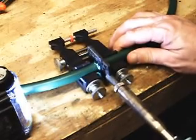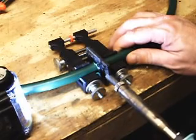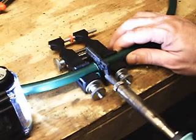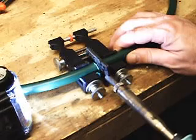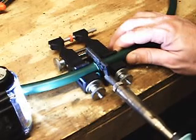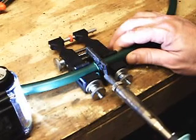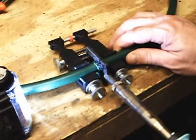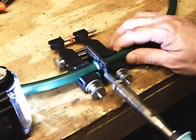The iron is in the dead center. I'm just going to kind of hold it there. Let it make both sides plenty warm. Not really trying to push left or right, just trying to hold it right there in the center. I can see some of the green round belt trying to bubble out, but it's not really sizzling. It can just do a low simmer, like you're melting cheese.